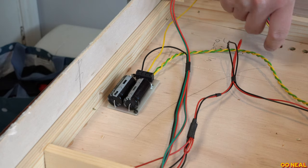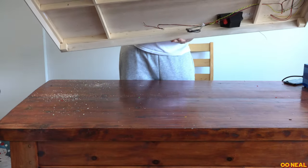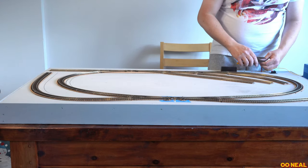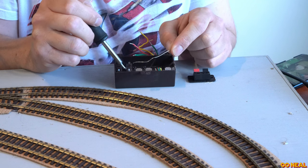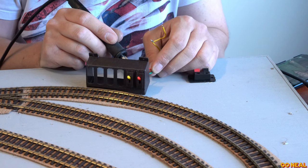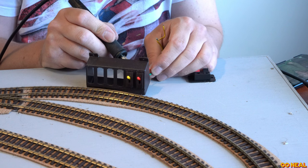We flip it over so we can work on it a bit easier. Stripping wires — I'm just using some old wire strippers. There are lots of fancy ones out there. I tin all my switch wires. You can use the connectors you use for cars — the push-fit crimp connectors. On one side of the switch I put the green, on the other side I put the red, and in the middle I put my yellow wire, which is coming from the capacitor discharge unit.